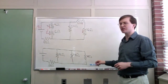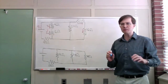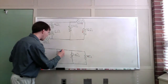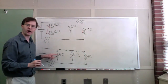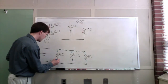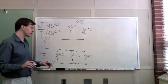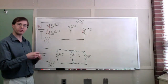The 16 ohm, the 24 ohm, and the 48 ohm resistors in this diagram are all in parallel. Remember what it means to be in parallel: the voltage drop across each one has to be the same. To confirm they're truly in parallel, the tops of those resistors all need to be connected by ideal wires — which they are — and simultaneously the bottom parts of all three also need to be connected by ideal wires, which they are. That's how we know those are in parallel.